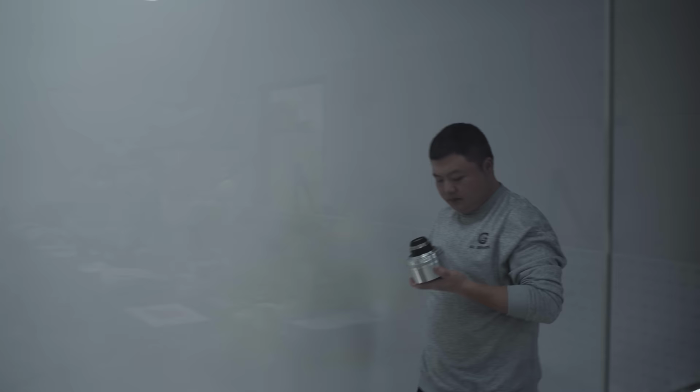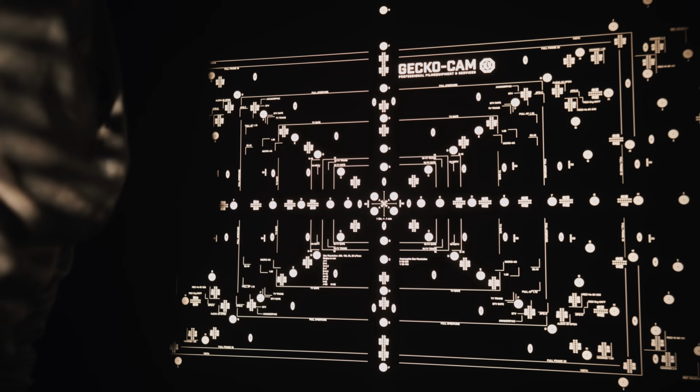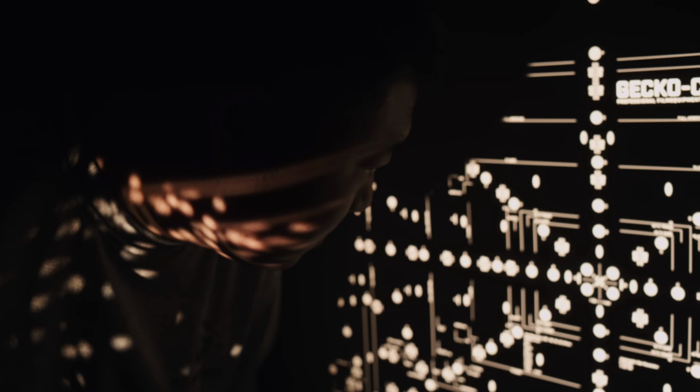Now that a working lens is assembled, it is tested and collimated. The lens is installed on the projector to ensure that all lens elements are correctly aligned and spaced. Only if everything is in order will the lens achieve the maximum resolving power of the design. Here we can see first improvements to the original lens.